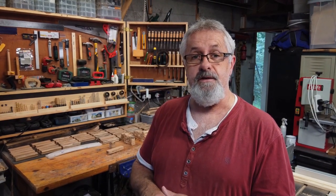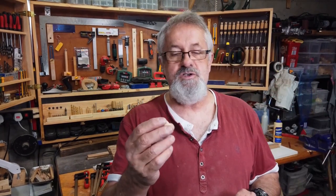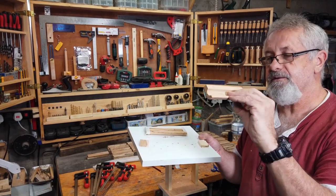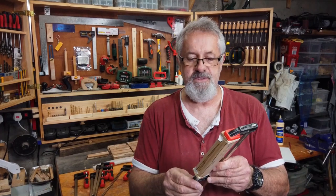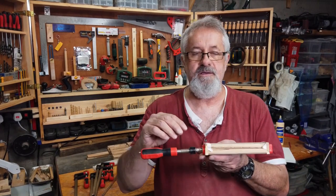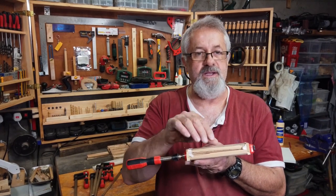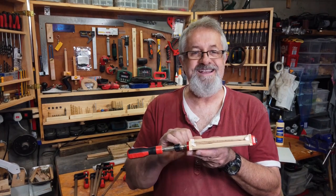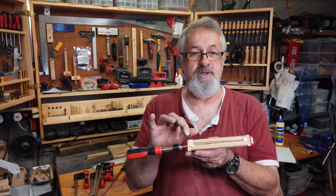Now it's just about organizing the workflow and then I can start gluing. The hinge side goes to the back, then I choose two end caps, put a bit of glue on either side, and clamp it together. The masking tape on either side has two purposes: one, to make up for the lid spacing because it's a fraction of a hair shorter; and secondly, the tape masks the lid so that the glue doesn't bond the lid as well.